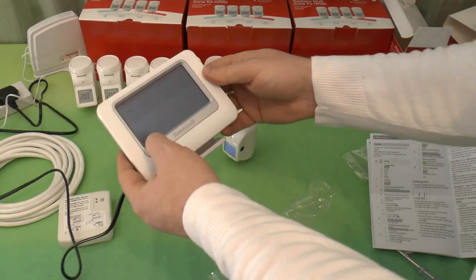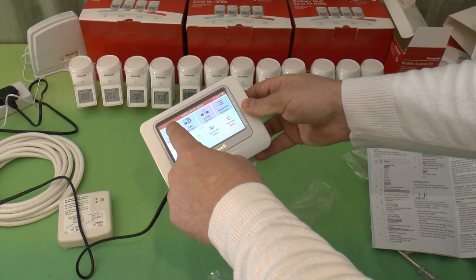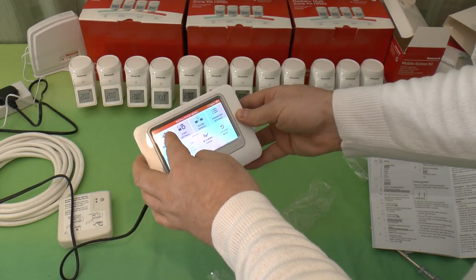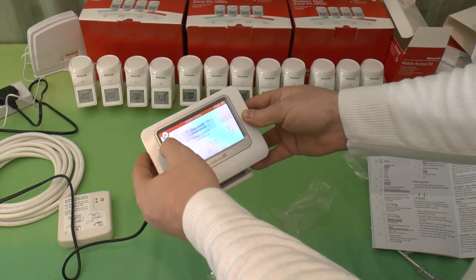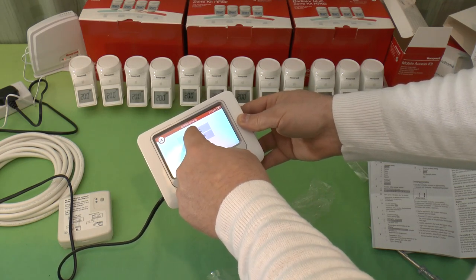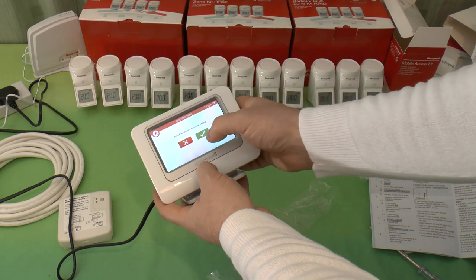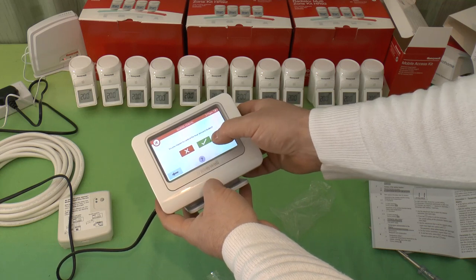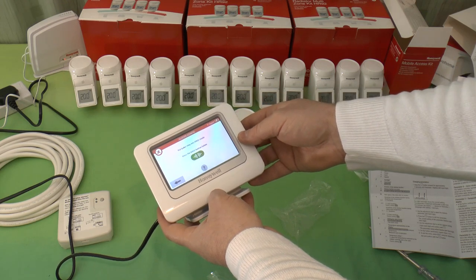let's see what happens if I go through the guided configuration. Let's see how idiot-proof this thing is. See if I can do it without going into the manuals anymore. So, guided configuration, zone control configuration, yep, because I don't have a hot water tank. This will remove previous zone settings, yeah, I haven't got any, okay. Do you require to control the heat demand? Yes, because it'll turn the boiler on and off. Boiler relay into bind mode, okay.